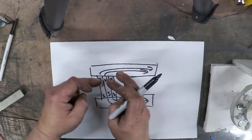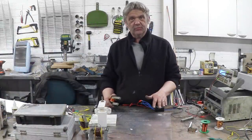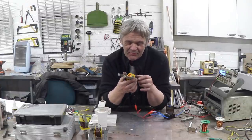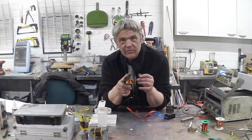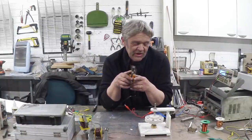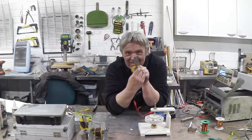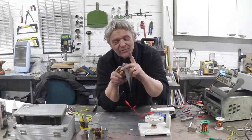That reversal takes place in the H-bridge — we covered H-bridges in video 965. The magnet definitely makes a difference — video 1036 confirms it makes a huge difference. This is designed to be easily made; I used laminations from a transformer, but any bar of metal will do. We want to make an axial flux magnetically assisted motor, and a good question is how to ensure the direction of rotation. It turns out it's stupidly easy: you just take your magnets and twist them slightly.